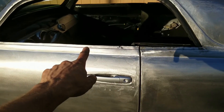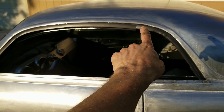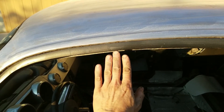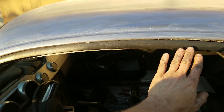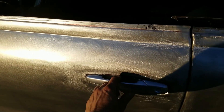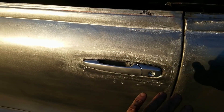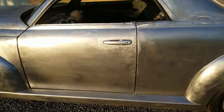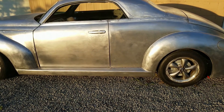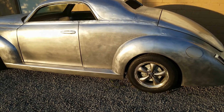There's going to be a weather strip across the top of the doors - we have to install that, and this is just mocked up on a couple of screws. There's going to be a rubber bulb that clips in underneath for the glass to seal on - the glass will go up and seal on that for a flush fit. The door handle is all finished - the linkage isn't hooked up yet, but you can see how well it blends in. We have a little pocket for our fingers and a reveal around the perimeter to sink the handle down into - it looks like it belongs there. All the glass has been installed, tested, retested, then taken out and put away so it stays clean for final assembly.